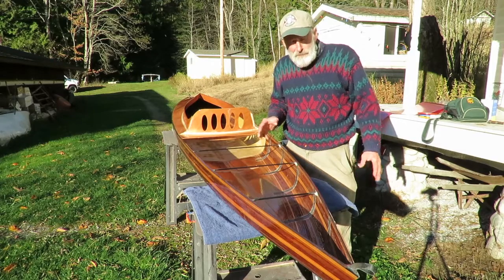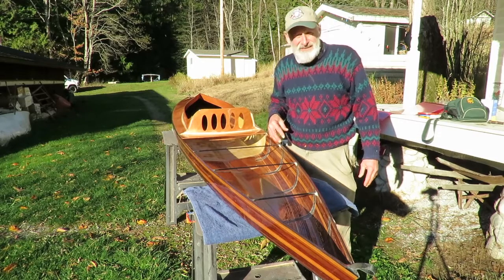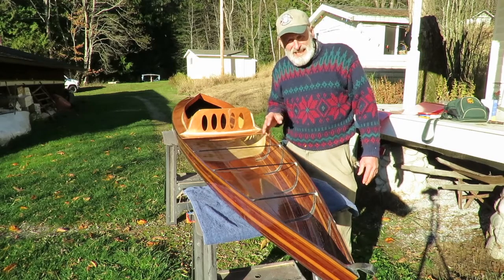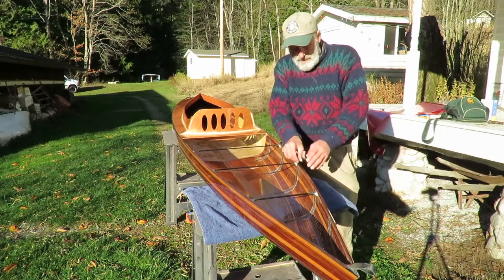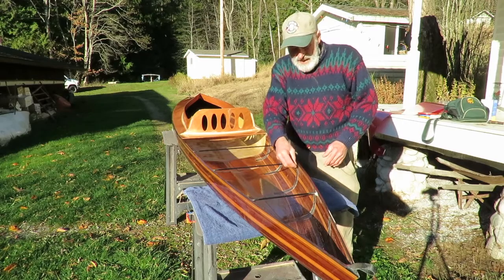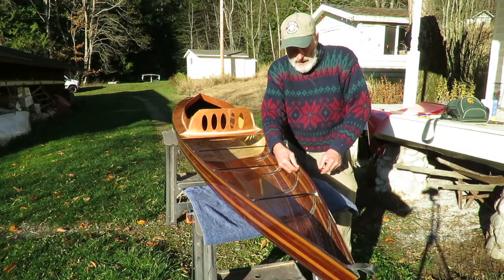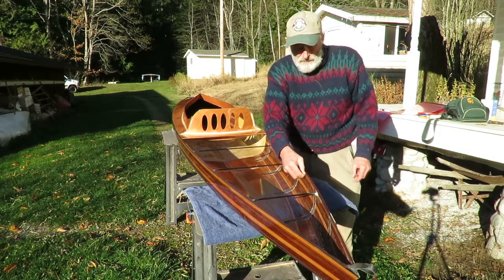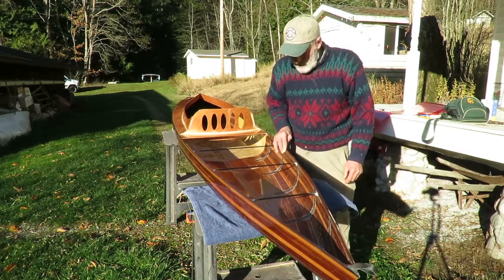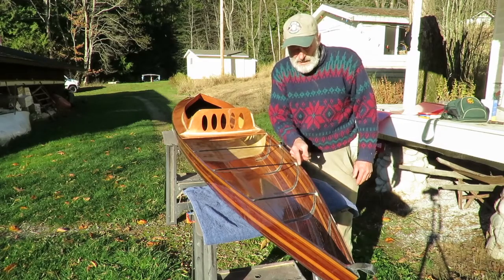Okay, so sometimes good design is a result of laziness, and I'm a good example of that. I'm basically pretty lazy. So we're doing the back deck slightly differently. Rather than trim off the orange tape, we've put the orange tape on in a slightly different position. Now we've started it with the inside edge of the orange tape about 1/8 of an inch inside the very top center line of that carbon fiber tube all the way along, and we pushed it down. So there's really not much tape on the inside. All the extra 3/8 inch orange tape is hanging out the outside.